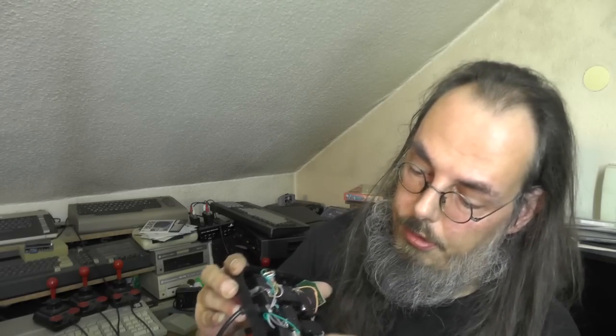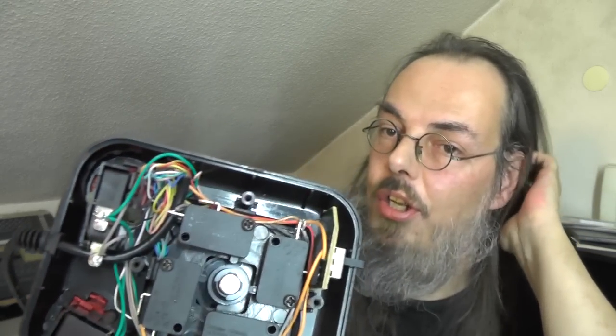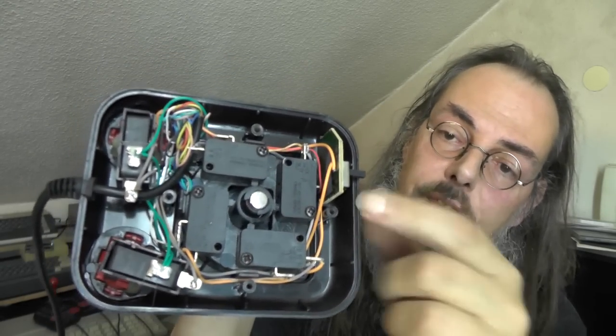I think I'm planning to build a joystick tester. Not sure if I just make it for basically Atari joystick, then it's a complete passive thing. There's some hot snot residue. The switches are soldered, but they are the correct size, so maybe I butcher one of those, solder in, yeah, I should show you also. Yeah, those would fit in the fire buttons, because some hot snot on the fire buttons. I don't like that.